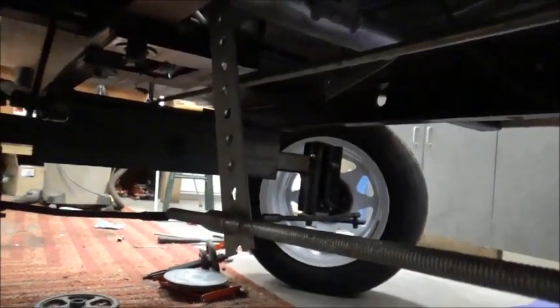That's the handle of the throttle. I welded a washer on the end of the handle, and then the rod goes all the way up and hooks to the gas pedal. I have this same setup on Poor Boy Polaris, and it works pretty good. The only thing you have to do is take out some plastic bushing type pieces in here that make the throttle really stiff where it will stay in place on the push mower, and on this I want it to be able to move back and forth really easy, so I took those pieces out.